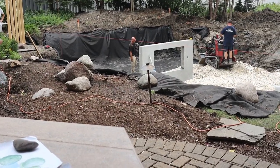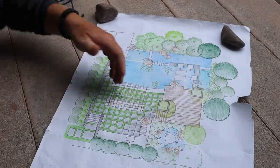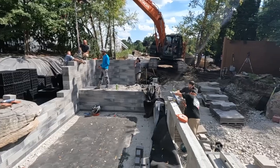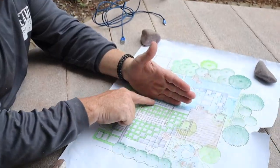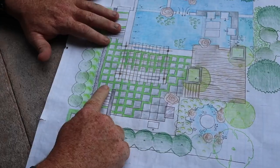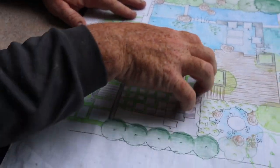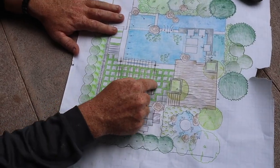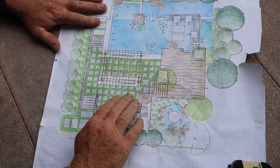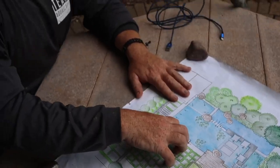This area is the icing on the cake: our koi window. You can see the precast concrete wall that's going to support that koi window viewing area. My favorite part is I tried to put it at a height that makes it more of a swim-up bar. If you're in the water, you can sit, kick your feet back, and talk to people on the dry side of the window. We set the countertop at 42 inches high — so on this side it's four feet of water, and on the dry side it's a comfortable bar height. Coming this way, you walk down three feet below grade, past steppers through artificial turf, down stairs into a big sunken patio. That area will be an island bar where people can congregate, with a pergola overhead connecting the swim pond area to the island bar, putting shade on the window and the people sitting below.